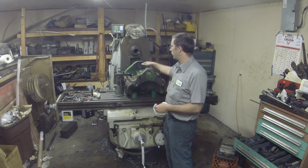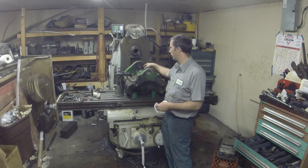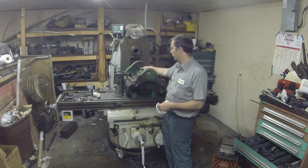The bushing will be a little bit trickier on this one too because it's got to have a groove in it, because the grease needs to be up here but the fitting is down here. So the way this is actually made is it's got a channel inside that the grease has to go around the bushing and then grease the top side before it comes down. Pretty good design until it gets wore to the point where the groove gets blocked off and then you're not greasing nothing.